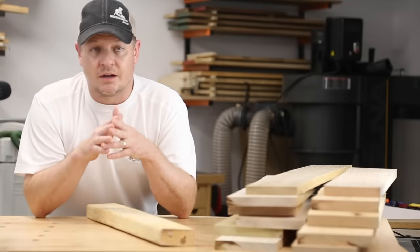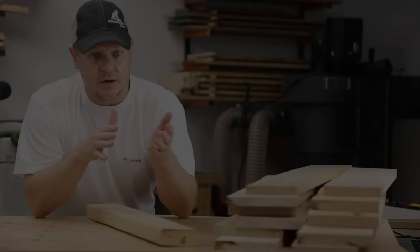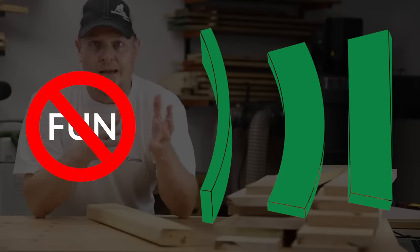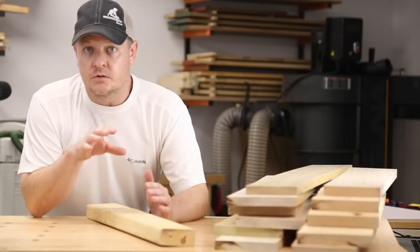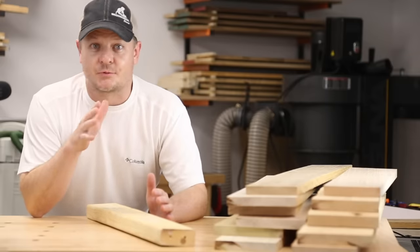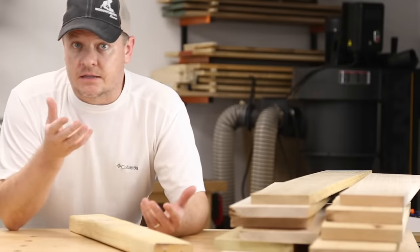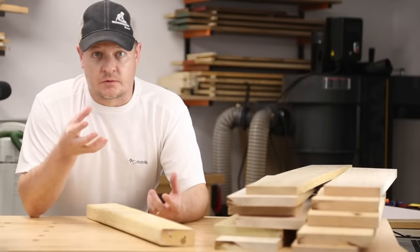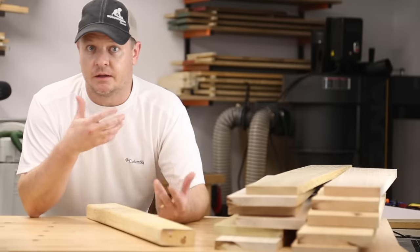If you've ever picked out boards at the box store yourself, I'm sure you've seen the downside to construction lumber. You've got to fight through a lot of twists, a lot of bowing, a lot of cracking, a lot of cupping, and all that stuff. That's because those boards have just gone unused a little too long — I'm only talking two or three days here. When they left the sawmill, those boards were straight. But with green and just slightly dried lumber, the clock is ticking. As wood dries out it shrinks, and when it shrinks it does all kinds of bad stuff like twisting and bowing and cupping and cracking.